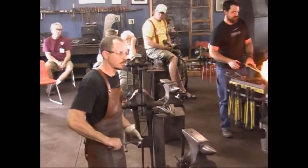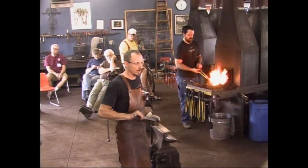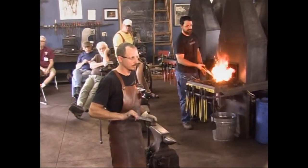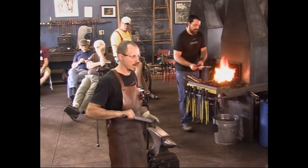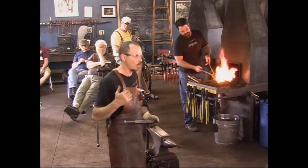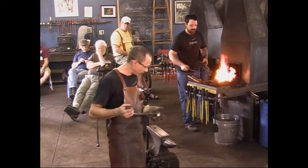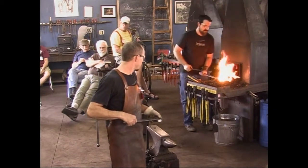What do you use to weld it on the handle? It's TIG welded. It's TIG welded on regular steel fill rod. So it's A36 handle, regular. I've never yet had one break on a weld like that, but I bevel it, so I try to get a 100% weld. I preheat the tool steel above 500 to do the welding.